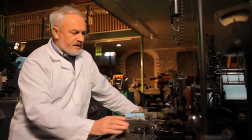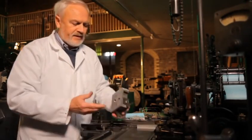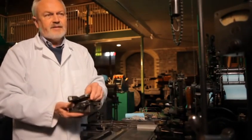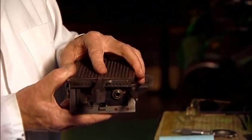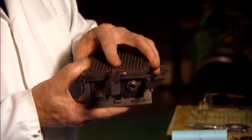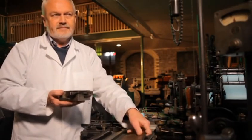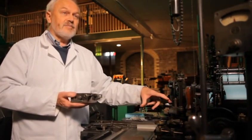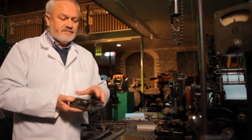You have the pump as well, of course, for pumping the metal into the mould. And when the mould blade is open, the metal is pumped up through the orifice, to the opening in the casting, and into the matrix, which is positioned above it. Because the mould is cooled by water, the type hardens immediately. The type is then ejected from the mould, brought out to the galley, where it stays until the line is complete, and then the final line is brought out into the galley itself.